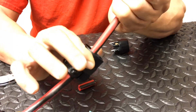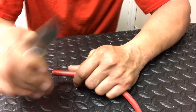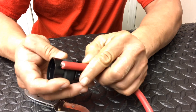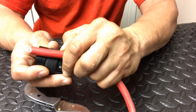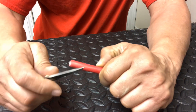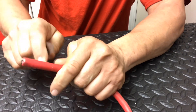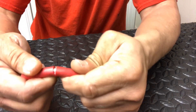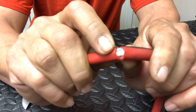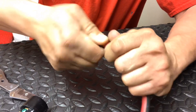The first thing you're going to do is slide this over, then we're going to strip the end. From here to the top here is basically all you're going to need to strip. You can take your knife and go around. After you score it — see what I did right there? I nicked the wires. If you nicked the wires, you are wrong. See those nicks? If this is barely nicked, start all over.